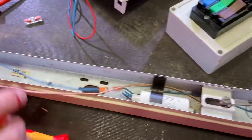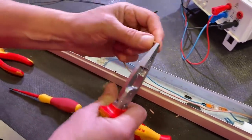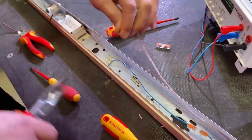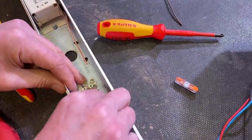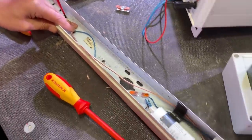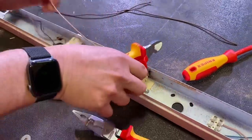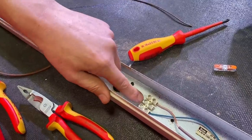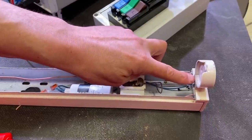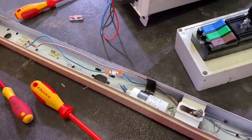And that's pretty much it. It's got a bit of brown sleeving at the termination point. The wiring is a little bit old so it's a little bit tricky to strip. It's a simple process — we go mains only, doubling over as well. So now this is our line conductor — pop that into there and make our connections. Just tidying up and cutting back the existing wiring. So if we look at our terminal block: we've got our line and neutral in. The pink is now the line conductor to the end cap, and the neutral — we've taken it and joined it where our power factor correction capacitor was — and that's direct to the end cap as well now.